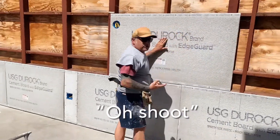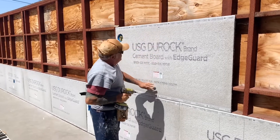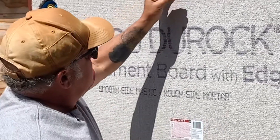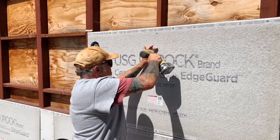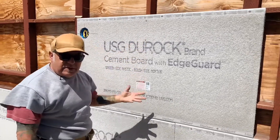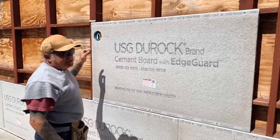I needed my drill — I can't let go of this. When you're putting the screws in, you want them at least every eight inches or smaller, so I'm going about every six inches. That's called the schedule. This area is called the field — here are your edges. If you ever read that it says to nail off your sheetrock eight inches out in the field and every six inches on the edges, that's what that means.